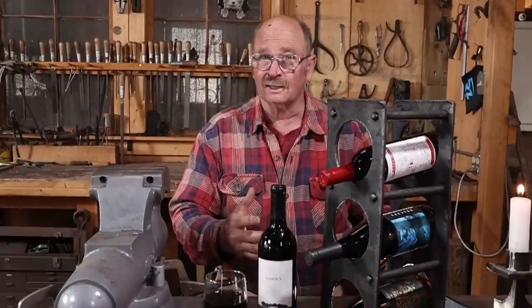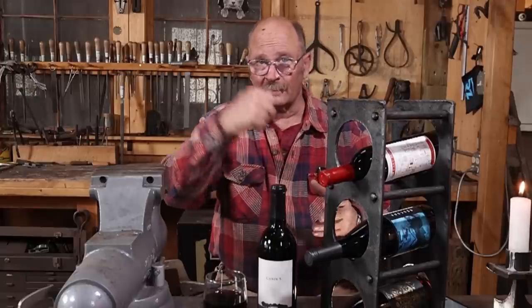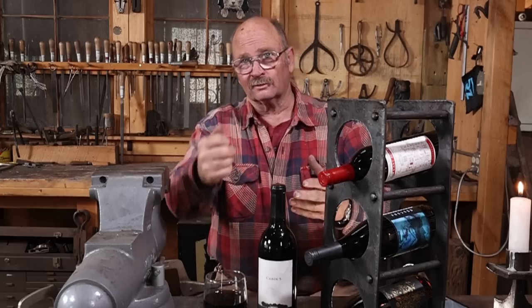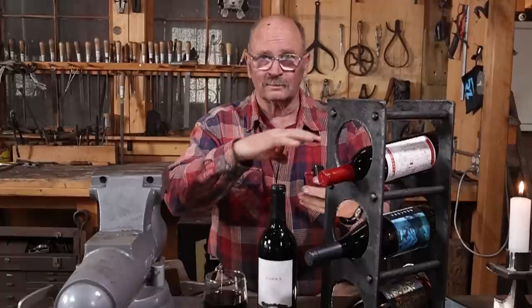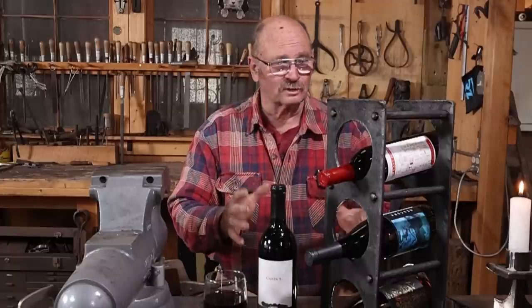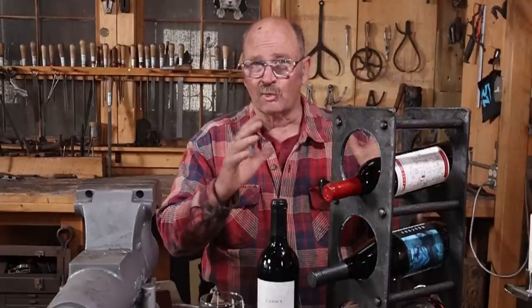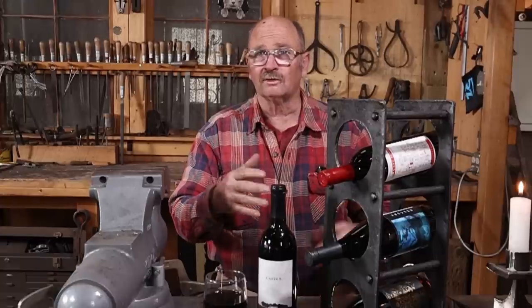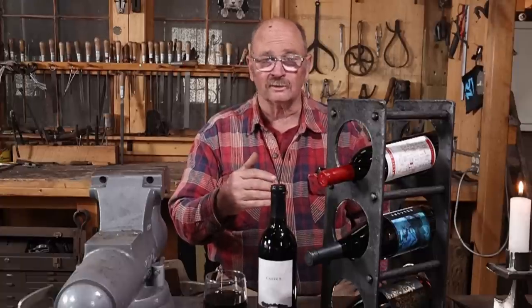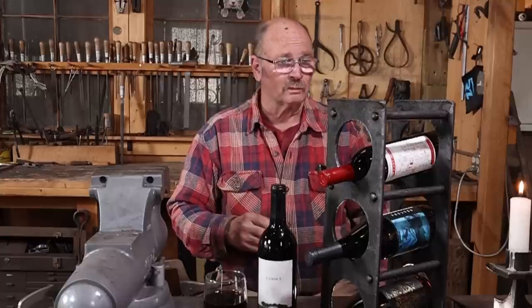I wish I could tell you exactly what I did that made this twist. I suspect it's the way I hammer the rivets, that I'm putting the same curve in every time and kind of pulling it around one direction, but I can't be absolutely sure. And I think if I had a forge this would fit back into, I could probably get it straightened out. And who knows, maybe I'll call around and talk to some of my buddies and see if anybody's got a forge that's that big. It's one of the benefits to knowing some other blacksmiths.